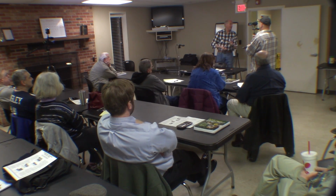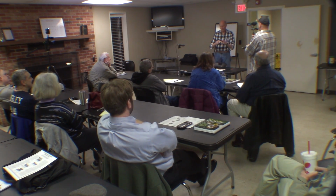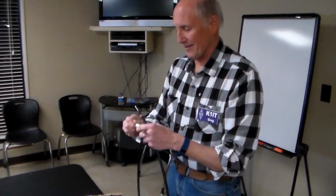the center conductor. Now, what happens at that point, and where you'll go wrong if you did it the old-fashioned way, is saying, oh, I've got to put the barrel connector on first. So you started by unscrewing this, and on your cable you put this down. You put the end on and then pull it up and tighten it up. Well, when you solder to the outside of this, this isn't going over it. So it'll save you. You don't have to think about it. I had to put that on first. See, I'm trying to make life easy for you. You don't put it on first. You leave it screwed onto your connector.